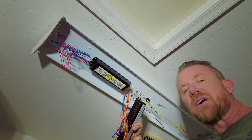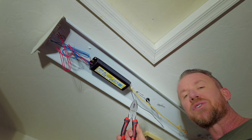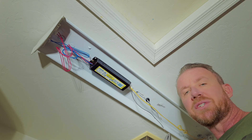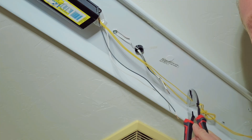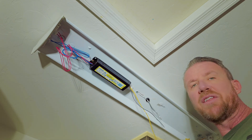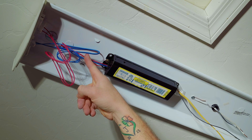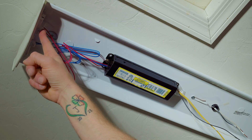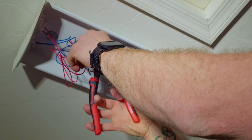Using our Klein lineman's pliers — I'll link all the tools and accessories you're going to need in the description below — we'll find some good spots to snip these old wires so we can remove the ballast from the housing. I'll go ahead and snip the yellow wires a little bit further down so they're not in the same spot as our tie-in for our power and neutral wire. Now that the yellow wires are snipped on this side, we'll go ahead and snip our red and blue wires over on this side. You want to leave enough wire — even though the wires on the new ballast are pretty long — that you don't snip them right next to the socket, because then it'll be really hard to tie those in. So we'll snip our red and blue wires about halfway through.